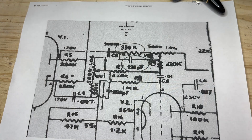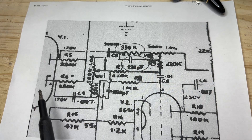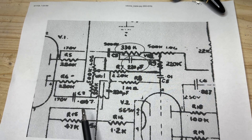Let's start looking at a schematic of a Vox amplifier and see how we'll turn it into something unique and awesome. This here is a schematic for a Vox AC30 treble model. A treble model is one that a lot of people may not be familiar with — many know the top boost model with treble and bass controls. This is very simple: two volumes. You've got a volume for your normal channel and a volume for your brilliant channel. There's a single 12AX7 here with two independent 220K plate resistors.